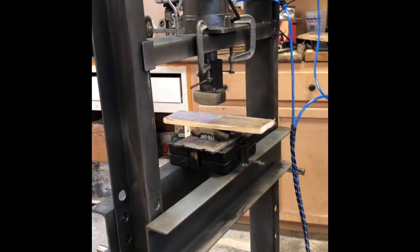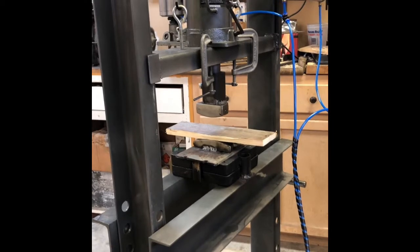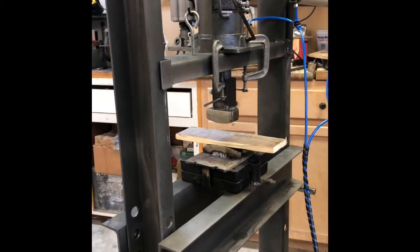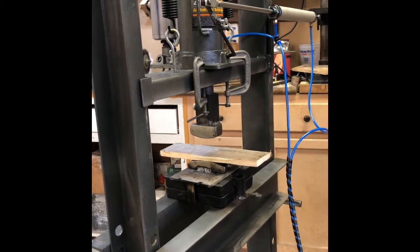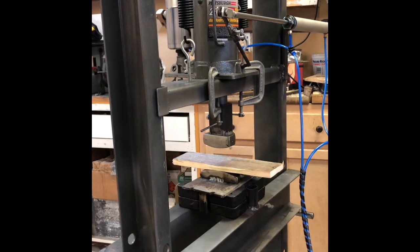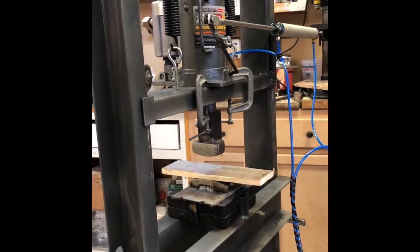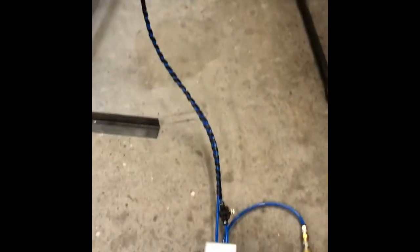You probably won't run out of air — you can hear my compressor running — but when you're mashing Damascus or drawing something out, you're going to have to reheat before the air compressor runs out. I've got a 3 horsepower 80-gallon air compressor and it'll be plenty adequate. Let me show you another view of the operation with the foot pedal down here.